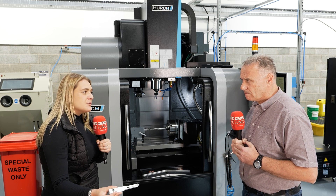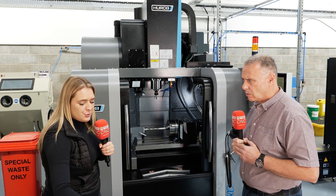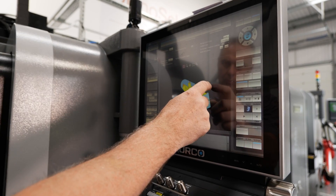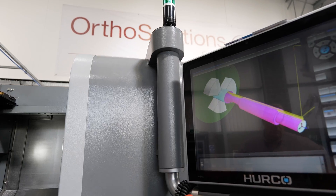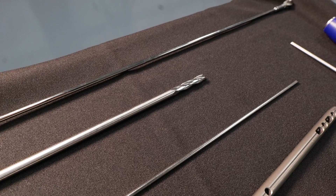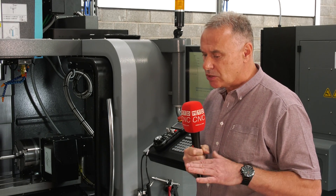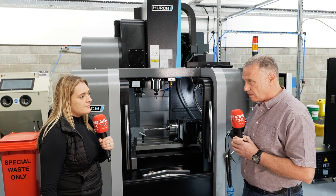So you're doing prototypes on these machines here and then they are going to go on to production. How are you programming that without CAD-CAM? Conversational programming. All the parts that we've created so far have been done conversationally. We are going to now focus on a CAM solution. The reason for the CAM solution is that we'll be able to finish the parts to a more cosmetically pleasing state — for instance, there will be corner radiuses that can vary around the profile of the part.